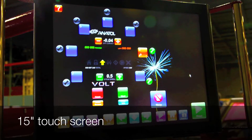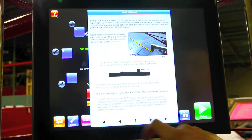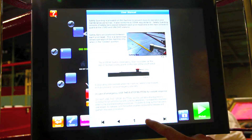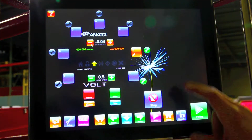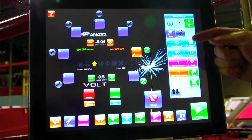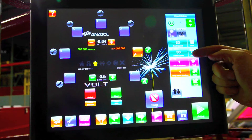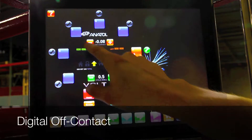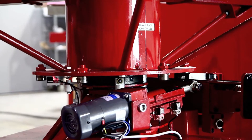With the ARIES operating system, the printer can customize the graphic interface and language. Simple one-touch digital controls also include print and flood speed, dwell times, clockwise or counter-clockwise indexing, and a plethora of other commands. Digital central off-contact via touchscreen allows for precise adjustments with a simple tap of the finger.